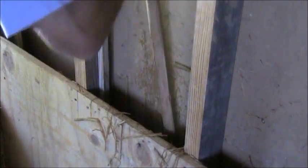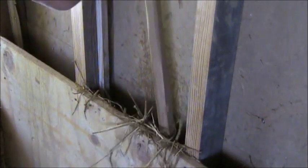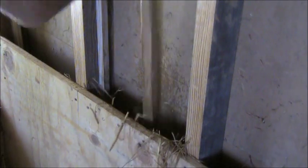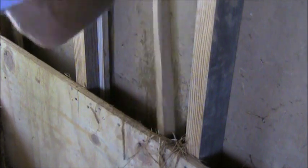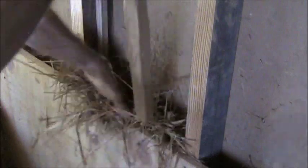I'm using a one-by-one stick — we have several of different lengths, because as you move up, certain lengths work better. As you get closer to the ceiling you'll need shorter sticks that can still reach to the bottom of your form. We ripped these out of boards we had. I found it helpful to take a chisel and round over the corners on one end of the stick — it makes it more comfortable in your hand, especially if you're packing a lot over time.